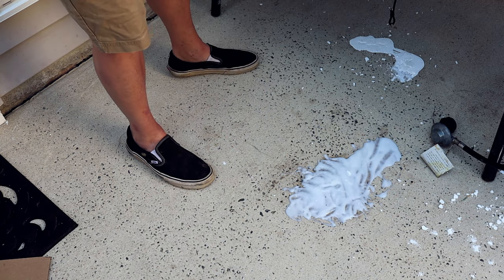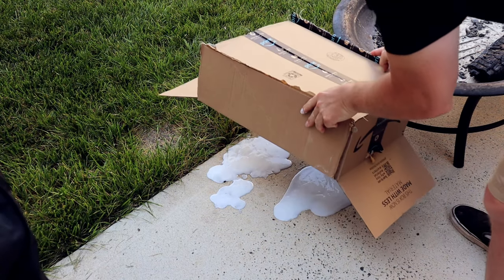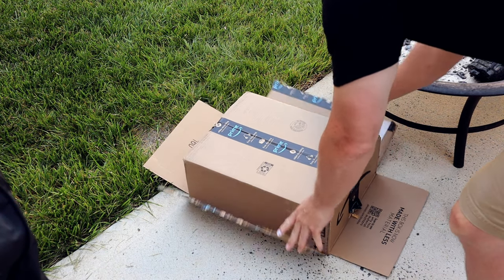There's $15 down the drain — we'll see. We're going to wait at least 24 hours, but what I'm going to do is cover these with some cardboard boxes. You don't want sunlight on it; you want to try to keep it as a liquid as long as possible so that it can absorb into the concrete and suck that grease stain up. Keep it away from any direct sunlight or heat, so we're just going to throw a cover on it.